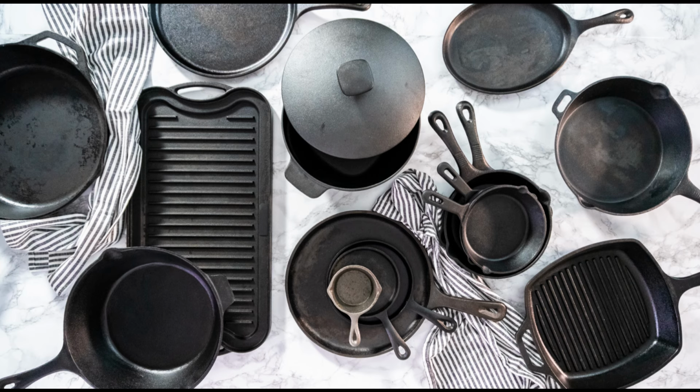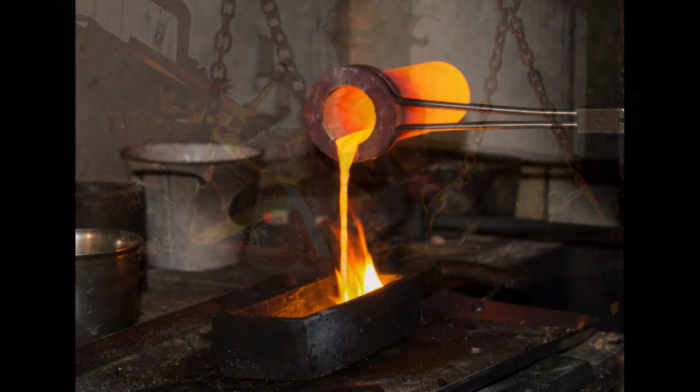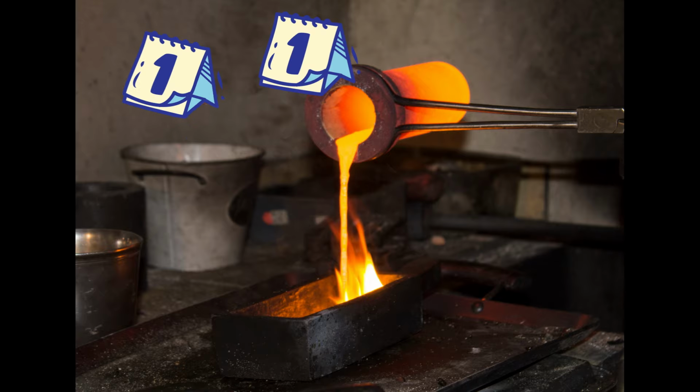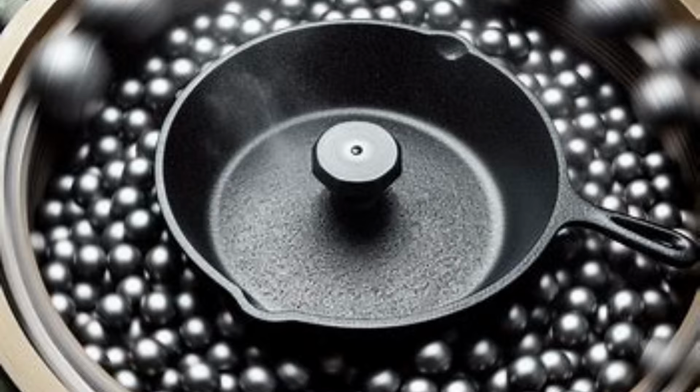The reason for the difference is that today's cast iron isn't made the same way it was just a few decades ago. That antique pan likely spent as many as 4 days in production. Cast iron used to sit up to 3 days in the mold, then was polished in a tumbler for up to 24 hours. The result was a finish that ranged from satin smooth to a mirror finish. As recently as the 1990s, you could buy a Lodge skillet with a polished cook surface.